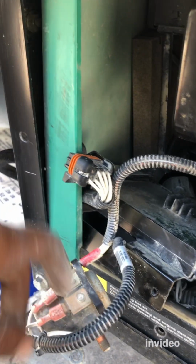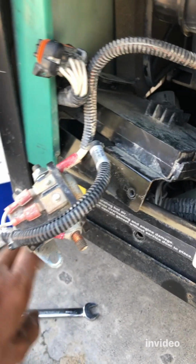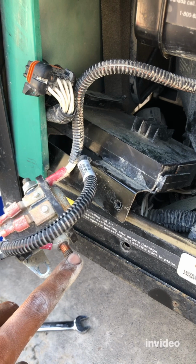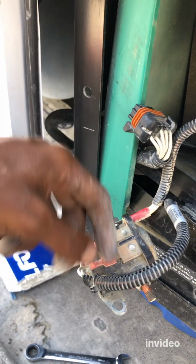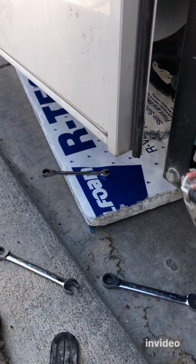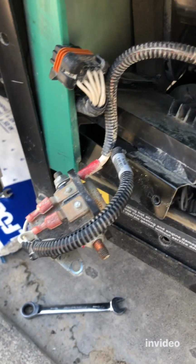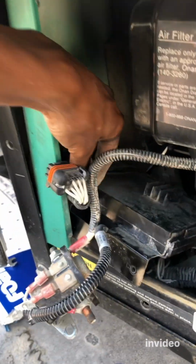Yeah, how many bolts? Like 1, this one, right? This 1, 2, and then the big bolt on the solenoid 3, and then disconnect this 4. What else? Oh yeah, and then the T nut, this thing 5. That's all you have to do. And then just wiggling this out and clearing it all the way.